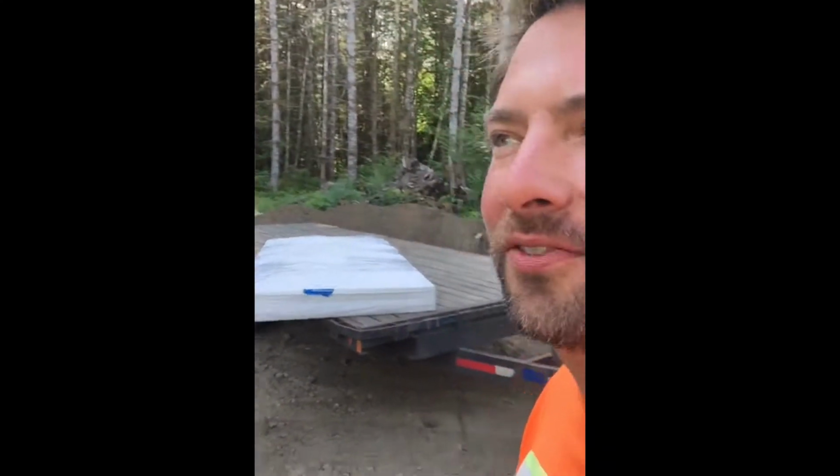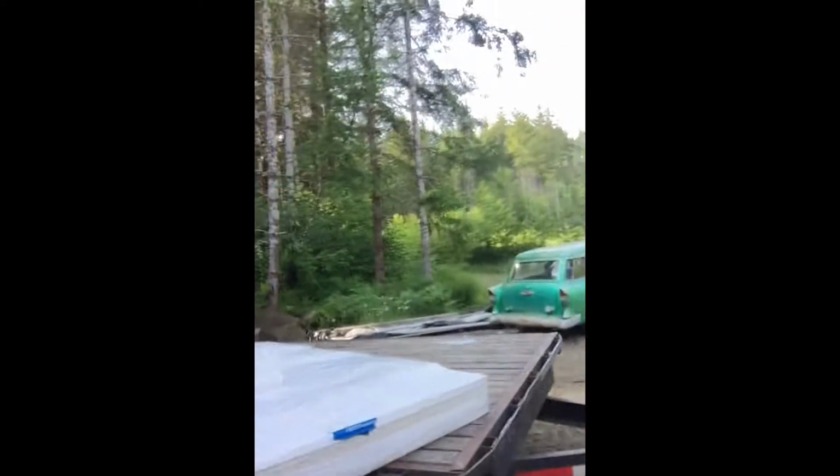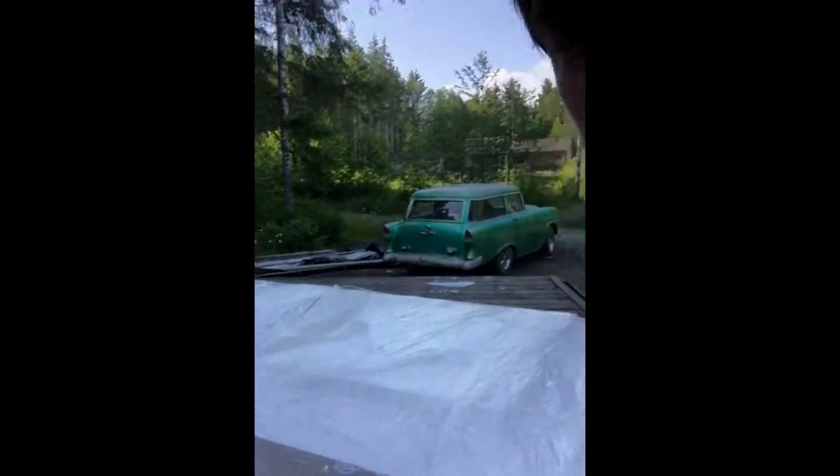The deck wasn't sloped at all, and we're in Washington State, so we had to figure something out: either rip it all off and start over, but what we're gonna do is use expanded polystyrene foam. So we found a company that would sell it to us. Here it is, sloped, it's tapered from 1.5 inches down to 1/4 inch, and it's gonna be up there on our deck. So that's our project.